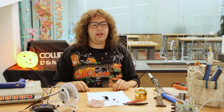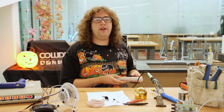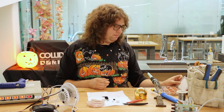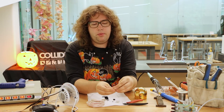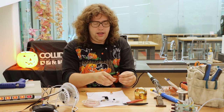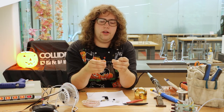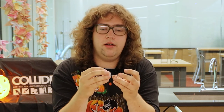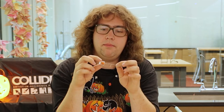Another thing to cover are some sundry tools that you might use anytime you're making electronics. In addition to the iron, there are other ways to bond your connections. Of course, there are the twist-on wire nuts — I don't have any of those because I don't like to use them, but they're available at every hardware store and they're installed in your home most likely. They also make these lever-style wire nuts, where the lever opens up the cavity for you to insert a wire or a component, and then you clamp the lever down on it, and that makes that mechanical and electrical connection as well. I love to use these. They're from a German company called Wago, and they're available in some box stores and also online.